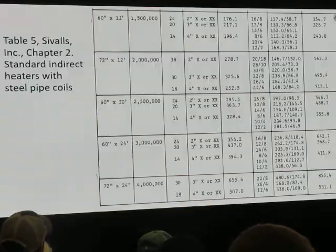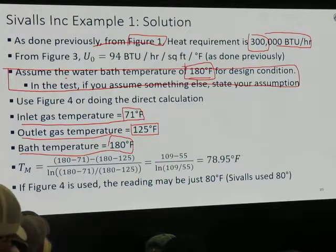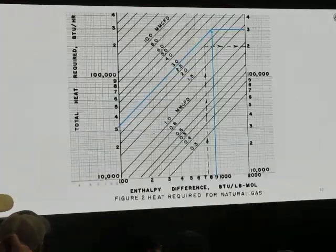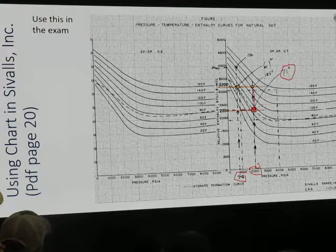Now we're going to look at the log mean temperature. We know that the bath temperature is 180. The coldest temperature is at the inlet, which is 71 Fahrenheit. The outlet gas temperature, Joe, is that before or after the choke? 125 happened before or after the choke? Before. The choke cools it down as well. Yeah, okay. Let's go back. 71 and 125. So we heat from 71 to 125,